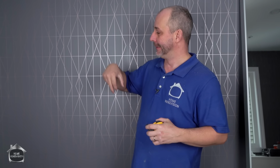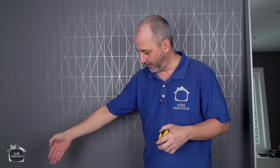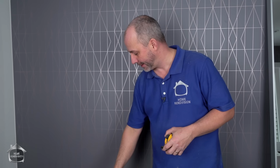And the same kind of principle applies here, only this time we're using a 12-inch deep pre-drilled hole wall board as the gables. We're still going to put the 1x5 across the top, but we're also going to build the lower shelf with a 1x6 across the bottom. That allows us to continue the baseboard trim all around the entire room. It gives a really nice look that complements the crown. So what we're going to end up with is a baseboard into the 1x6, right into the shelf that's going to be fixed in place.